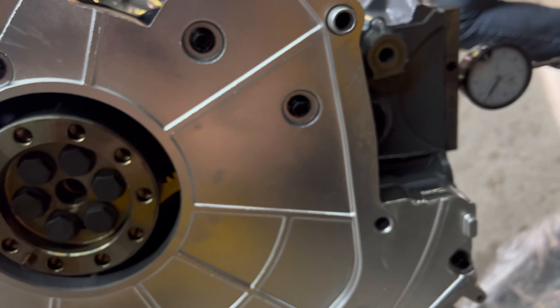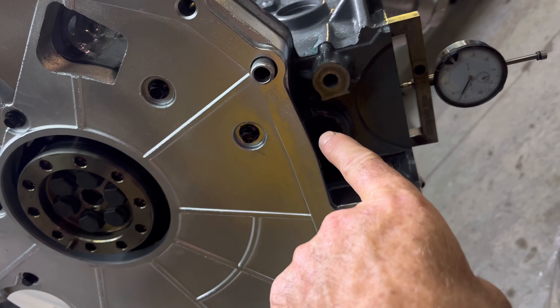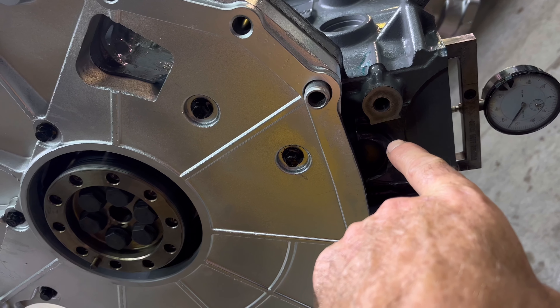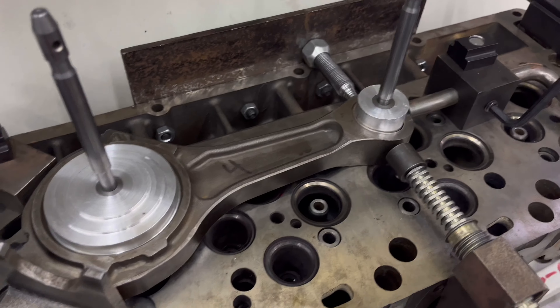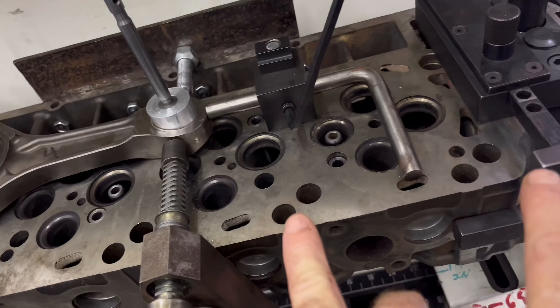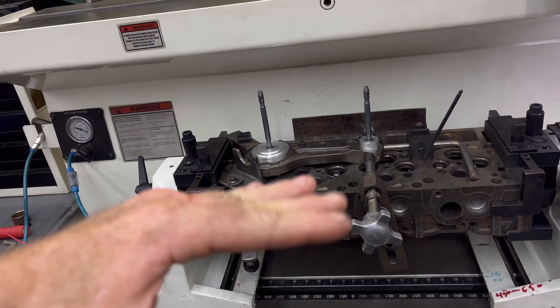The upside of the connecting rod as it's in the fixture is letting the piston go farther this way, so I am boring it toward the right-hand side of the machine. To fight that I need to figure out the fixture orientation. We know that the side over here needs to go that way. The one pushing it away means I need to take the deck and go that way — so how much do I need to surface off this side?